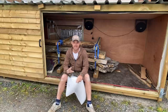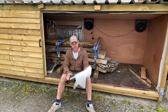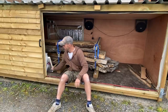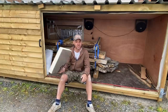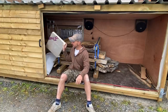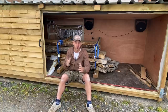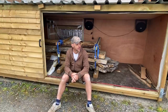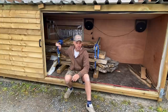If you heat it up, it takes days to cool down. Mainly, I think, down to this stuff, which is like a packing foam that I use, you can buy on Amazon. And then the whole kiln, every part of it, has got a 50 mil kind of Ecotherm or Celotex foilback. And it really, really is efficient. I actually now run the kiln on a timer, on and off during the day rather than on constantly. And I'm gonna go much more in depth into that, how I use the kiln, what I use it for.